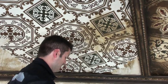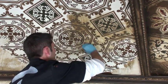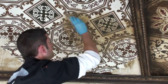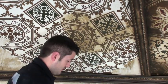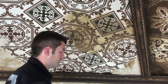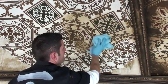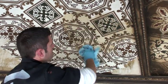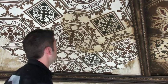This kind of starts antiquing it and knocks the whole thing back. Really scrub it in there, then do a section — just take some shop towel, make a nice pad, and just wipe it right back off. Then continue to work the entire panel. It's a real light stain.